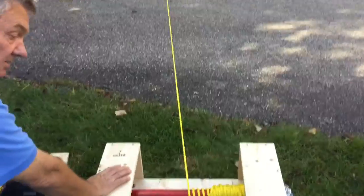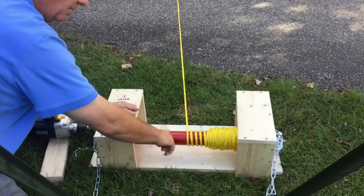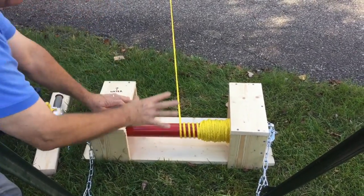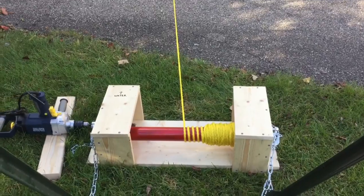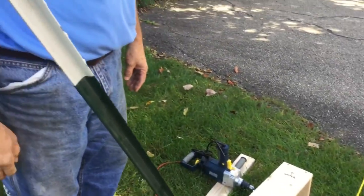See how nice the line is coming in now — it's lining up. One other thing about this winch: if you pull on the bare drum you have more power than on the balled-up part. The bigger the diameter, the less power that you have. And that's the lesson for today — we hope you enjoyed it. I'm your host John Wagner, the inventor. Thanks for watching.